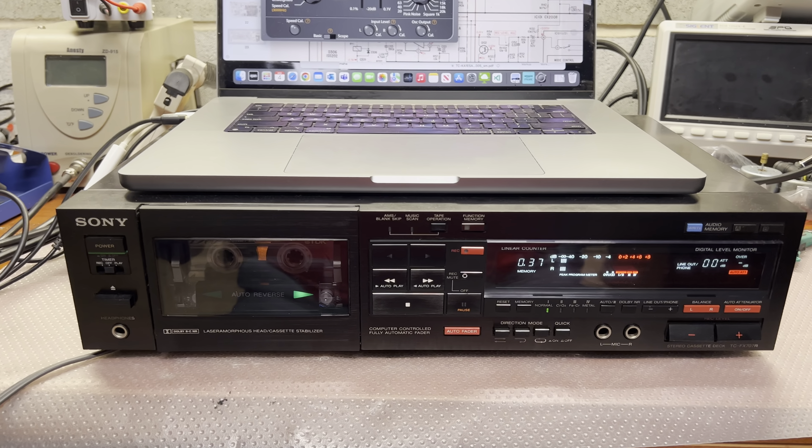Hello guys, and here are all the replaced capacitors for your reference — you may see which ones to replace. In total: 2, 4, 6, 8, 10, 12, 14, 16, 18 capacitors. The only discrepancy from the schematic I found was for C153 and C253 — I installed them as 22 microfarad as per schematic, and here I will install 4.7 microfarad. So let's measure how it will perform and then decide. See you soon.